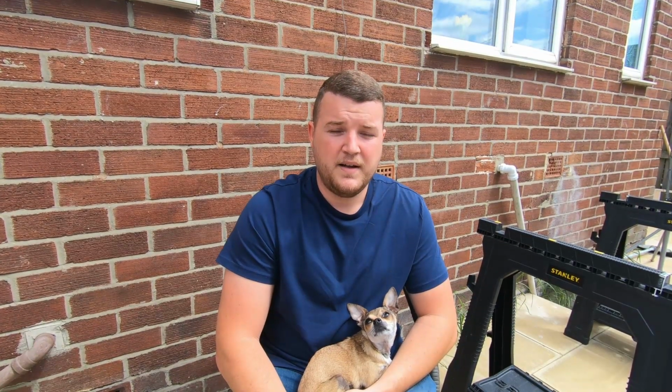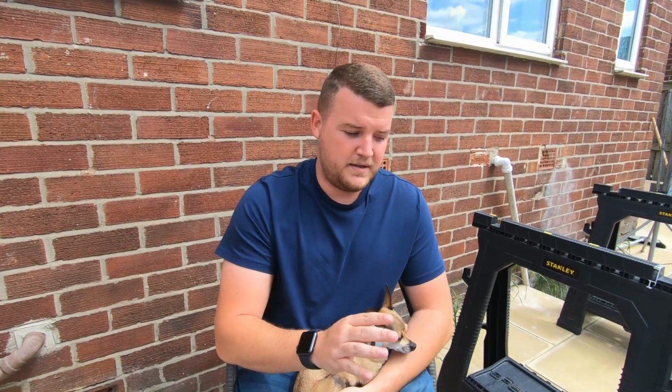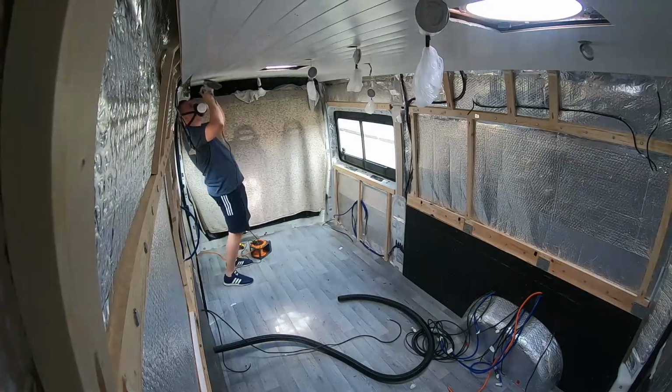And we're going to sand and paint before we put the cladding in. Now, we didn't last time and we noticed that there were gaps in the paint and bits were starting to crack. We made a mess with wood filler. We're going to varnish it to keep the natural wood colour rather than the white, and we're going to do white walls so the ceiling will stand out.